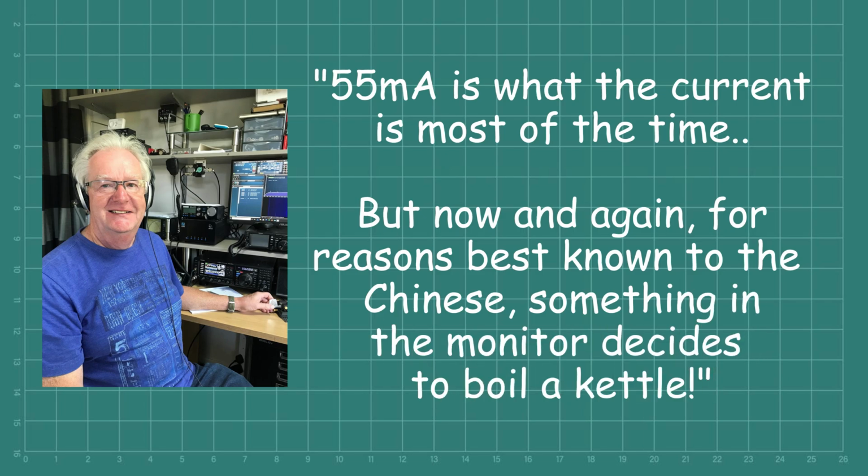The fact is that these transient events happen all the time, whether we like it or not. It could be an electrostatic discharge, a lead being plugged in, rapid switching occurring in the sink device. It's always going to be difficult to pin it down to one particular cause without knowing the exact specification and circumstances of each case. What we do know, however, is that limiting the 5 volt supply current as stated in the HDMI standards to 500 milliamps would almost certainly mitigate any issues.